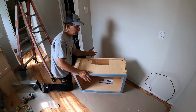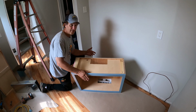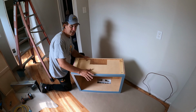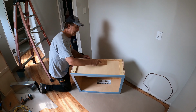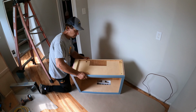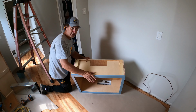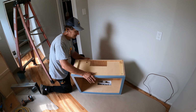First cabinet's gonna go in, it's the one over the cook stove. So that vent system needs to get installed. Read the instructions, go over the measurements, because now we gotta cut holes in the brand new cabinet to get that ductwork and the wire in. So go over those measurements, measure it at least 3 times, cut once.